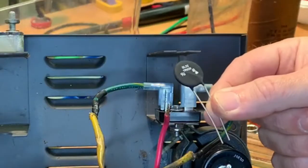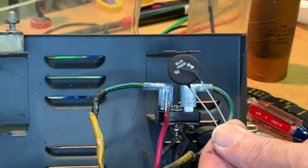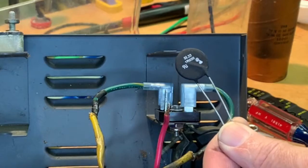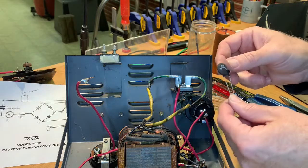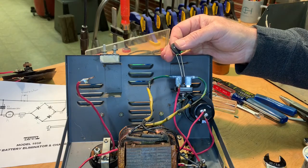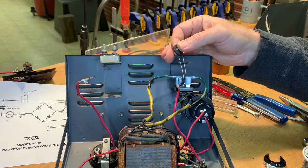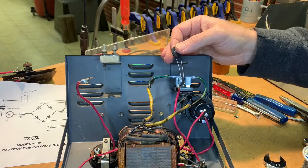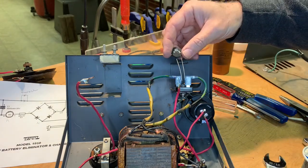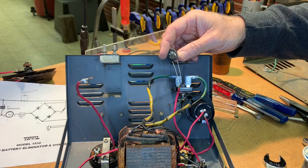What is this? Tell us about this. That is what they call an inrush current limiter. It has a high resistance when it's cold, and when we turn on the power, it limits the current flowing through it until the capacitor charges up. It's a thermistor inside there. It gets warm, and its resistance goes almost to zero. So after a fraction of a second or so, just long enough to give the capacitor a nice easy start, we have full power available for whatever we want to do.